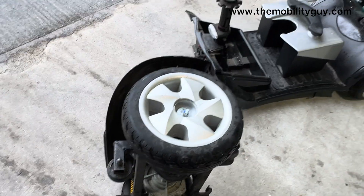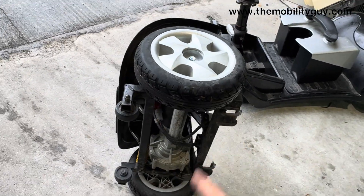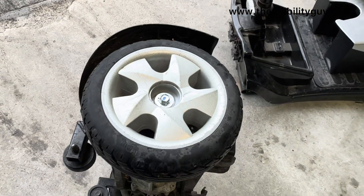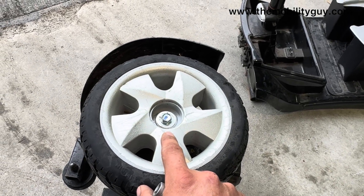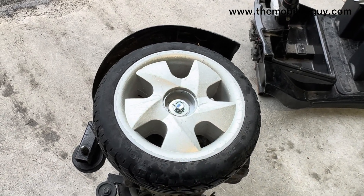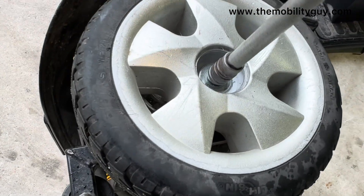This is a machine that can be split apart for the car, so if it's one of these smaller machines, split it apart — it'd be a lot easier. Just remember: if you want to undo your wheel, you're better off doing that when the machine is all together, because you can have someone sitting on the scooter while you loosen the wheel. Trying to hold it up and undo the wheel at the same time is just awkward.